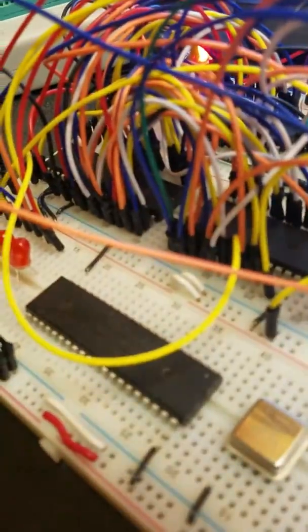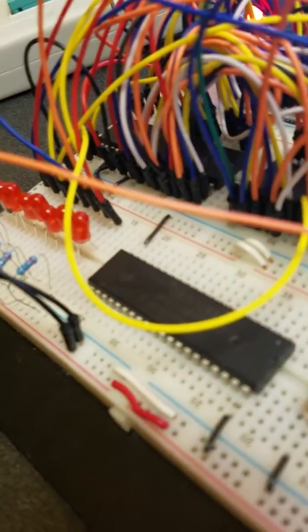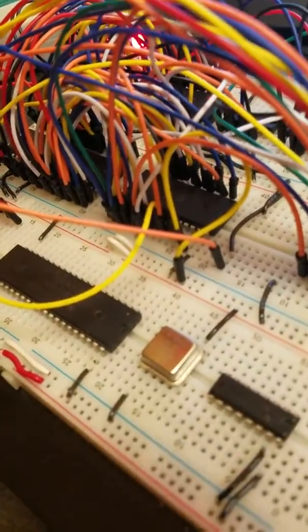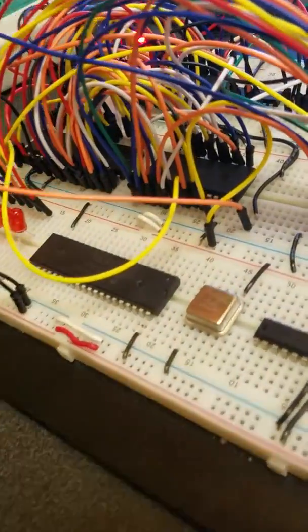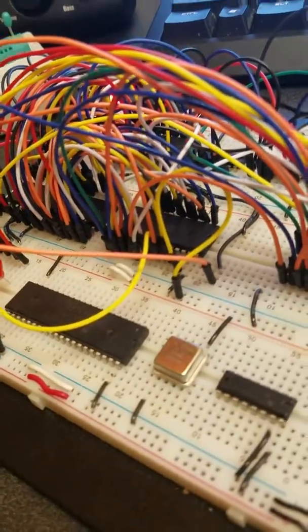So what this program does is it starts with the A register at 0, and it points the HL 16-bit register at memory address F000. And it'll run through a loop 255 times using the DJNZ loop, where it'll start B at 255 and decrement once, and jump back to the beginning of the loop. So what it's going to do is write A to whatever memory address HL is pointing at, and then it'll increment A, and then it'll increment HL. So A will now be 1, HL will be pointing at F001, it'll write 1 to F001, increment both, it'll write 2 to F002, all the way up to writing 255 at F0FF, or F0FE.